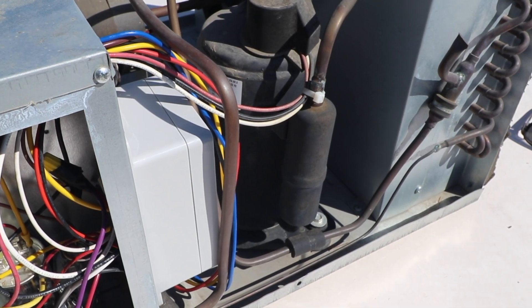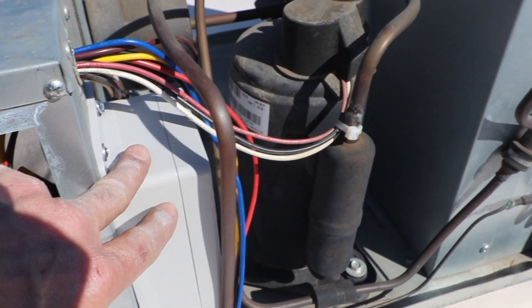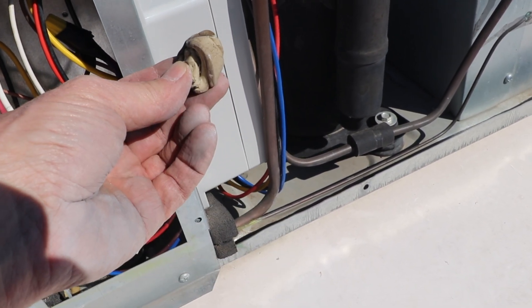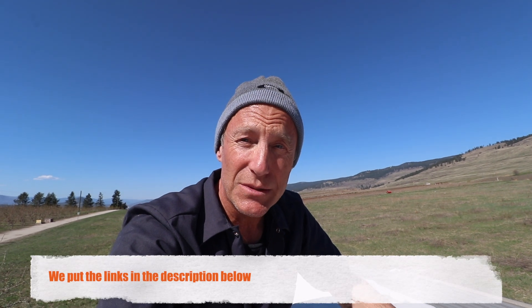With our successful test, all we had to do was put the Soft Start box inside the AC unit — there are a couple of spots you can fit it depending on your unit. Clean up the wires, make sure they're all out of the way, and reuse the putty around the hole to make sure no moisture gets into the wire assembly. If you test your unit and don't get the results you're looking for, there is excellent support from Soft Start — you can start a chat online, which runs seven days a week during regular business hours. Take some pictures of your installation and they'll help you out.